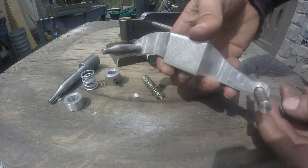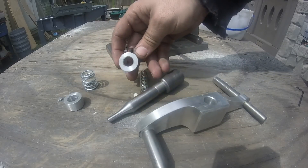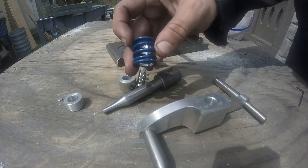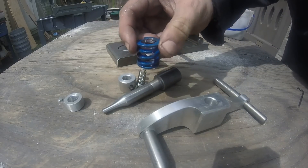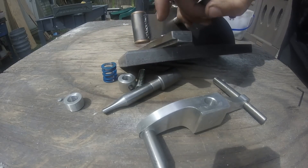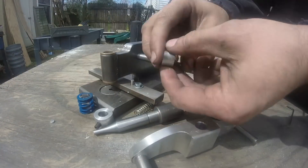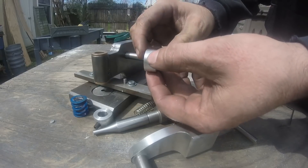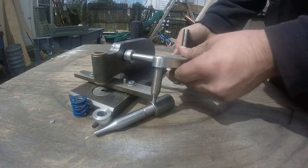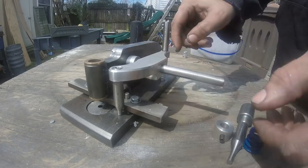Here's all the rest of the components. I made a few more steel pins and some collars. Here's the spring — I had to get rid of that wimpy spring and get a real die spring; I had to turn the inside a little bit. I also changed this bar to add a ledge, and that will act as a stripper to hold the part down. The footage on these lathe parts just wasn't very exciting and the video itself was pretty bad, even by my standards.